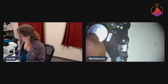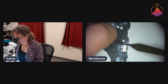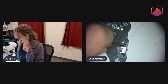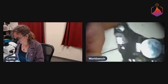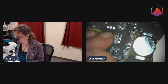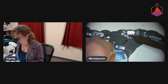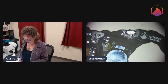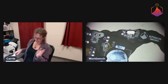And it's funny, companies try to sell you patterns, saying you don't have to make your own. Dude, there's hardly a pattern I've encountered that I haven't changed in some way for the purpose I'm doing. It's just part of making boards, and that's okay. Pretty much any pattern I've had a problem with has been one that I have not created, and I have not spent enough time checking with a printout and an actual part before getting the board made.